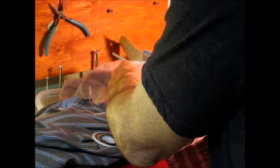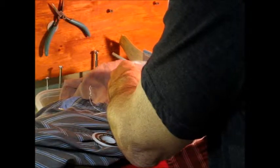I've got some rosin paste flux, so I'll try dabbing a touch on that. Put it where you want solder to be, which is on the back face of this control and the wires. Solder's actually flowing to the case of the control now. This lead-free solder, they've really come a long way with it. This silver bearing solder gets the job done without exposing you to all that lead hazard. That's nice. Let's see if I can get that to flow just a touch more. Oh, we've got a nice new control soldered in here.